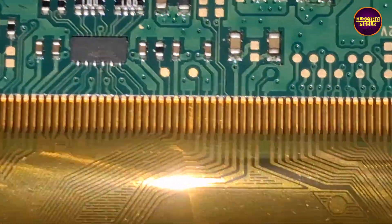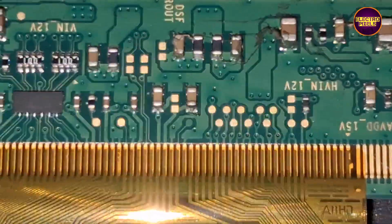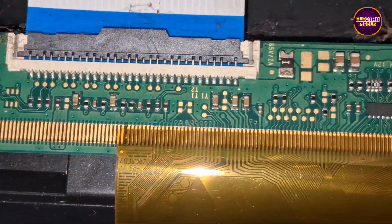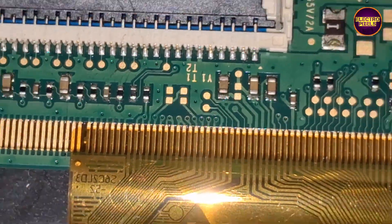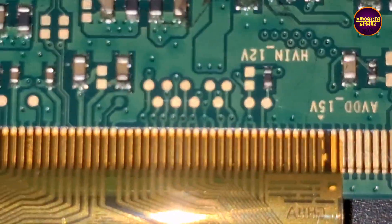This TV comes with a single COF Samsung panel with SM4186 DC-DC IC. Due to internal shorting in gate signals, the panel's DC-DC IC goes into protection mode.